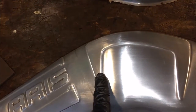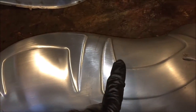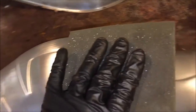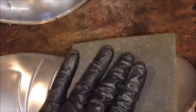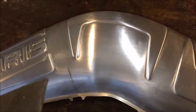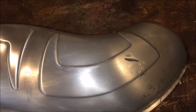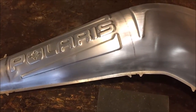The next step is using a sanding sponge — it's pretty fine — which is going to bring the aluminum up to a nice clean surface before we start polishing it with metal polish. One important thing: when sanding, don't go in circles. Go in straight lines because you want to grain it. If you do circles, you'll get weird marks that are hard to get out in the final polish. So we'll use the sanding sponge with nice straight lines, then move on to metal polish with a polishing wheel.